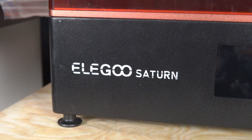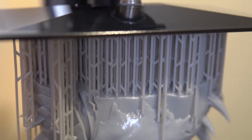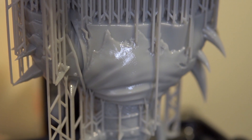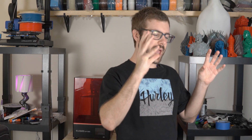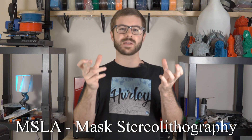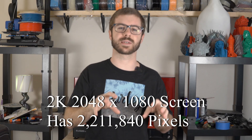The Elegoo Saturn I reviewed came equipped with a 2k LCD panel, and the results were really impressive. But quite a few people pointed out that if the Elegoo Mars with a smaller build plate has a 2k LCD screen and the Saturn with a larger build plate also has a 2k LCD screen, doesn't that mean the quality will be inferior? Technically, yes — the way MSLA or LCD-based resin printers work is the LCD screen decides the level of detail, and the smaller 2k screen has denser pixels giving higher resolution, while the larger 2k screen has slightly bigger pixels giving lesser resolution.